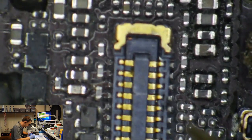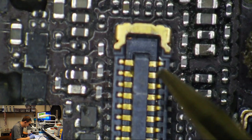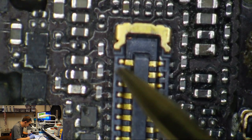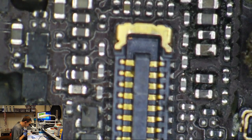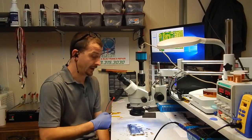We got to have power somewhere because this thing's got some backlight. I just don't have all of it. So there we go. We got 4 volts on this backlight anode, and about the same sort of reading on those cathodes, which is 0.00 whatever. With all the other repair attempts, I'm not going to be hitting this board with hot air.